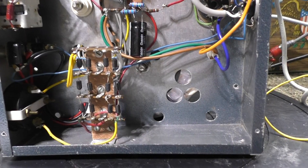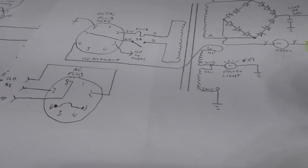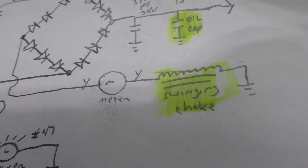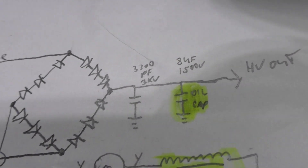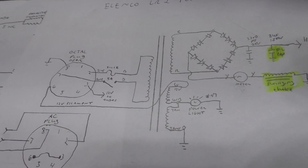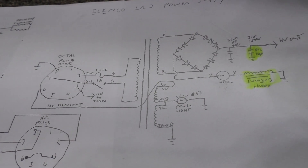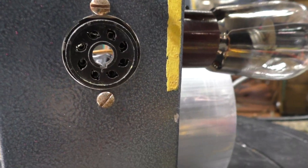Here's the inside of the amplifier. Going over to the power supply — it's a pretty basic power supply. I've got the swinging choke, which they put in the negative lead, which is kind of smart, and then the oil-filled capacitor, though I've since removed those. This is a reverse schematic I made of the amplifier, since there's hardly anything on the net for this one.